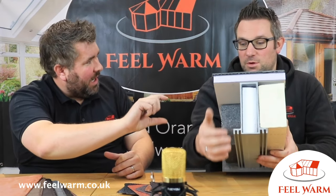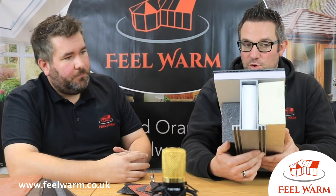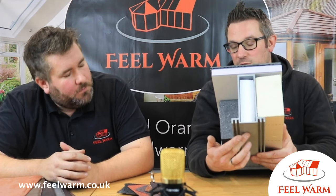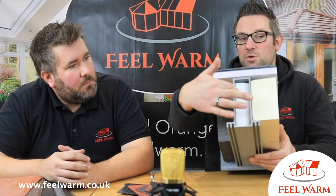So, moving back to that point about these companies having that insulated board on the bottom. They've got insulation between the rafters, yes, okay, that complies with the regs. But it's a lot shallower than the Leka, right? Absolutely, it's already 100 mil. But what do you do here when you've got your heat running through that rafter that goes up through there?